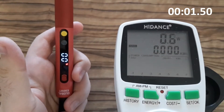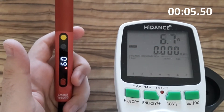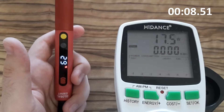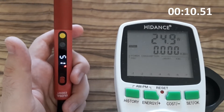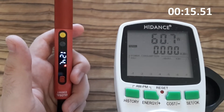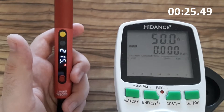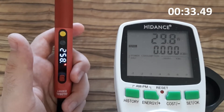In the first experiment I'm testing the heat-up speed and the power dissipation. I'm heating up the soldering iron to 500, which is the maximum you can adjust on this soldering iron, but I don't recommend doing that of course. I usually adjust it to 350, depending on the soldering tip.